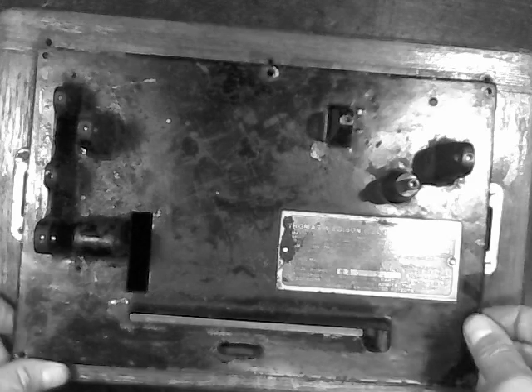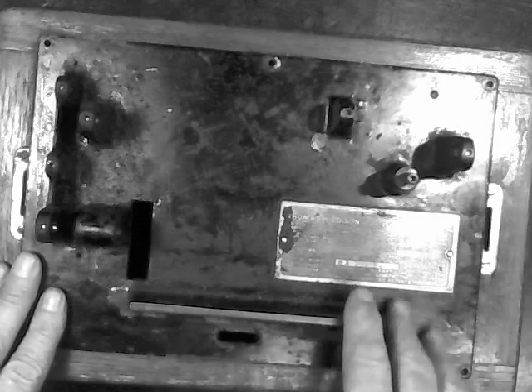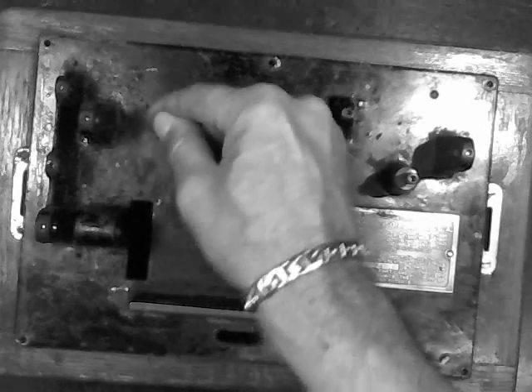What I'm going to do now is strip this bed plate. I've found that epoxy remover — it's a thick gel, extremely toxic and really corrosive, you have to be really careful using it — you just put this in an aluminum pan. You put it on with a natural bristle brush, let it set for a few hours, and you can come in and scrape it right down to the bare metal. We're not going to sand it, we're not going to sandblast it — we're going to do this the easiest, simplest way possible, getting all the paint off and down to the bare metal. Then we're going to clean it, primer it, and repaint it.